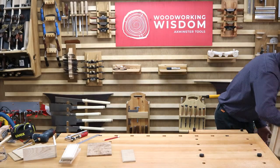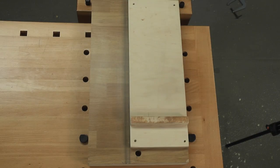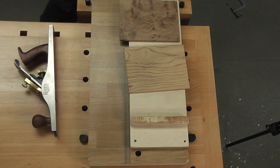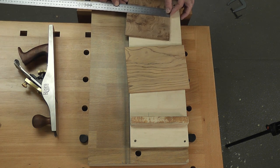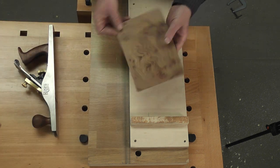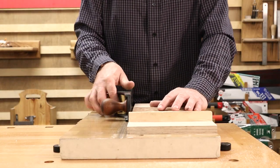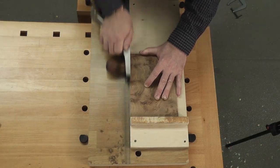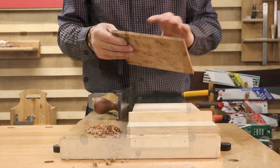I need flat faces — this hasn't got a nice flat edge, it's actually a board edge. So I'm going to clean that one up to start with. Back to the plane. I can use my shooting board even for this — this is about cleaning up and giving us a nice clean edge. That's good. Now we've got a nice clean edge. I could shoot an end, but actually we want the width first, so I can use the marking gauge. Easiest way to set this up — I'll stand it up so the camera can pick that up. I've stuck it right up on there so I can use the prong down to the table, resting off the back of the top. That gives me the width of the panel I want. The cutting wheel on here is dead flush with the top, so that should be correct.